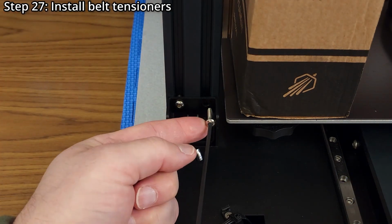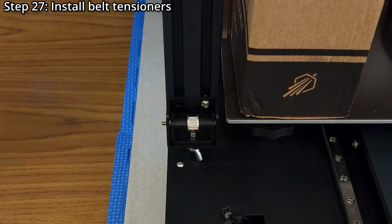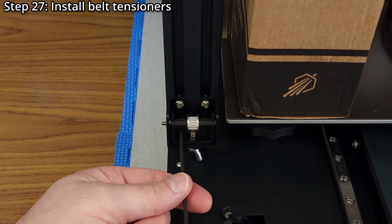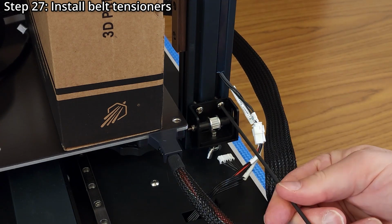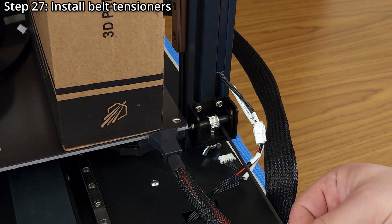Start by lightly tightening the top screws, and then lightly tightening the bottom screws. Next, remove a top screw and verify the T-nut rotated when being tightened. A flashlight might be helpful. Reinstall the top screw and then verify the other T-nut. Fully tighten the T-nuts.